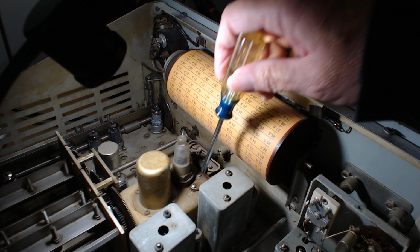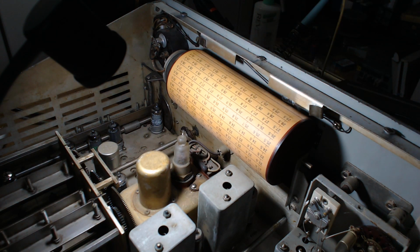And that hatchway, if you take it off, you're going to see a nut. It's a 1/4-inch nut. You just loosen it a little bit, and that'll let you turn this screw that's in the middle of it, and you can adjust the frequency in there. And don't work on this unit unless you have a good frequency counter. So you are able to move the frequency. You could use something like WWV if you don't have a frequency counter. But you better know what you're doing. But that's where the adjustment is on the real old ones.